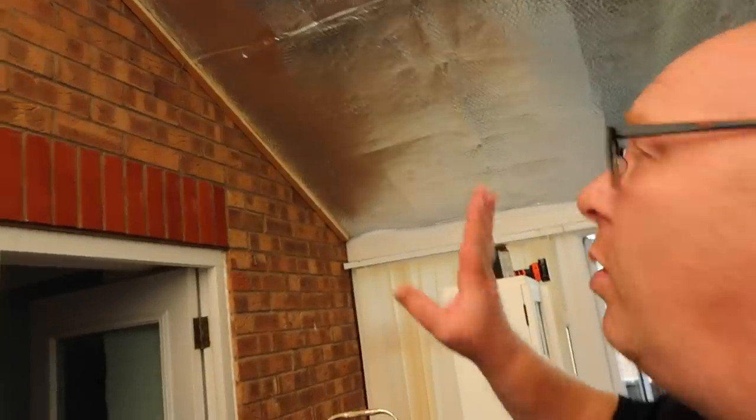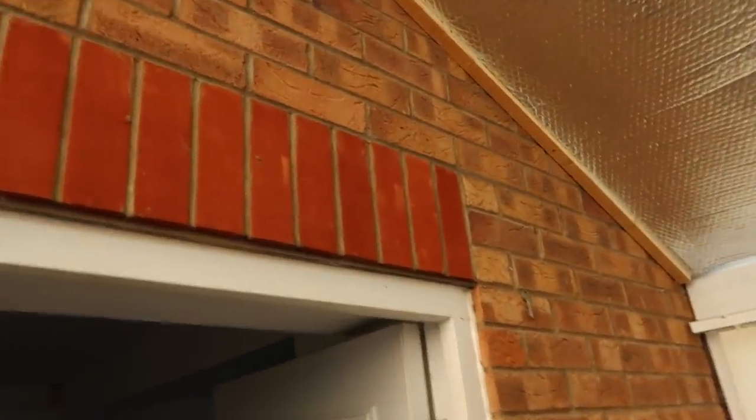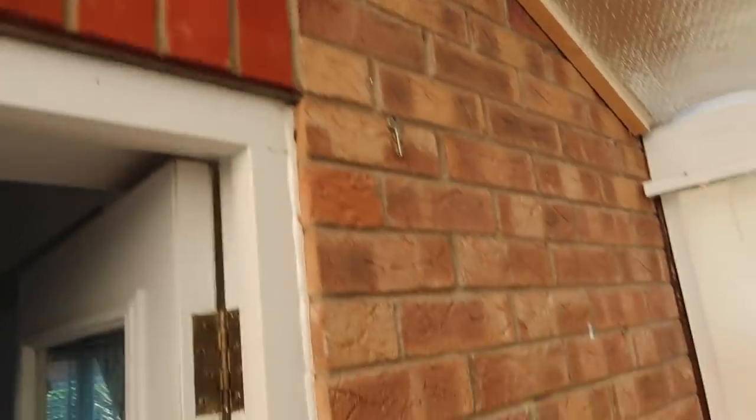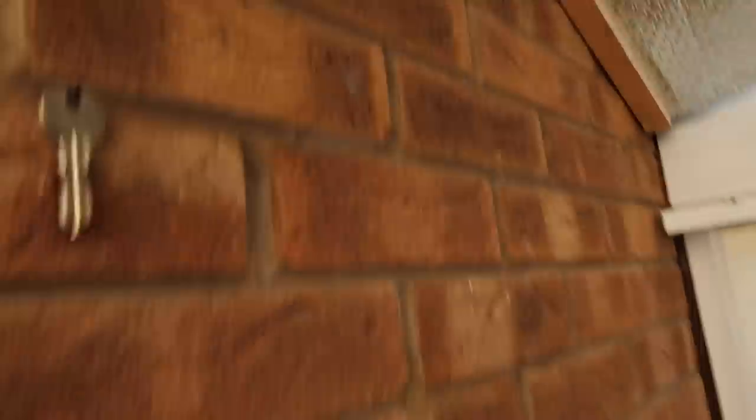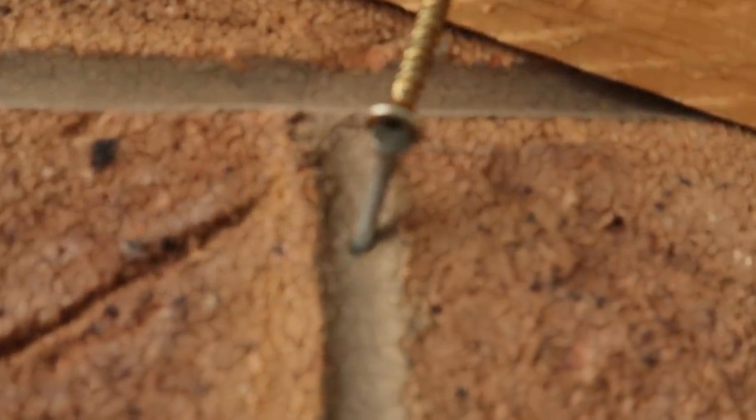Good morning folks, it's Wednesday. June's not at work so this is the problem. What I'm now doing is putting battening on top of the battening so I can fix the cladding. But this is the kind of problems you face - I've pre-drilled the holes and offered the first batten up, but what are the chances? For the visually impaired: I've pre-drilled the hole in the battening wood, offered the wood up, and there was a masonry nail from Christmas decorations nailed into the wall right where my screw needs to go.